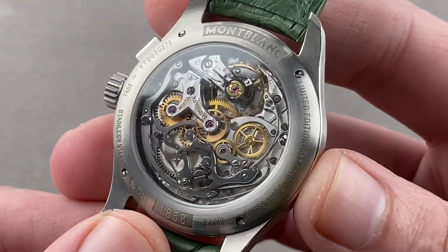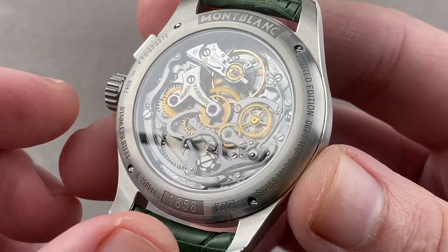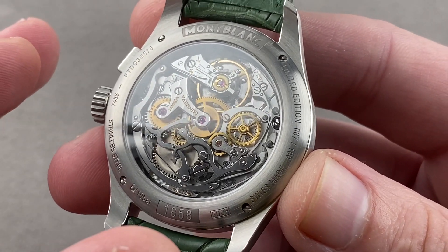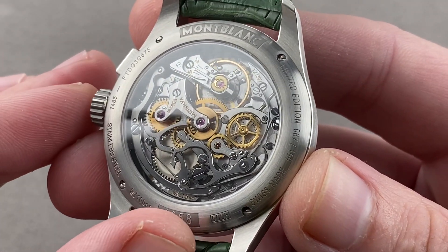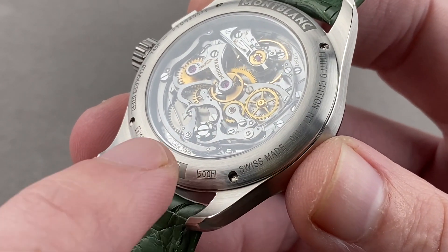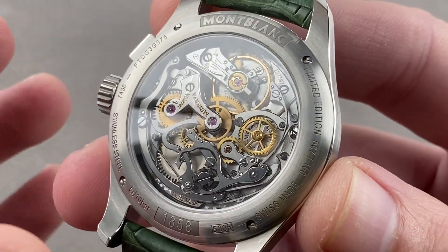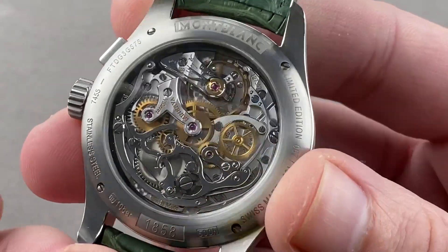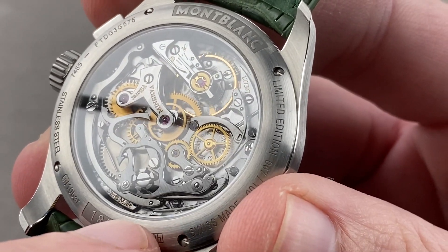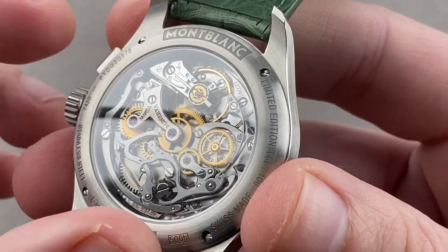Flipping it over, Caliber 1321 is based on the 1920s Caliber 1320, the two numbers variously describing the size of the movement and the year work started. On the reverse side there's a surprise: a stainless steel watch, not expected in this class — but what you also can't see is that it's 100 meters water-resistant, which makes it surprisingly sporty for a timepiece that at first glance appears to be the consummate dress chronograph. Limited edition, individually numbered out of 100, Montblanc puts all of its watches through a 500-hour test of chronometry and durability. Caliber 1321 is smaller than the other Montblanc Villeret Minerva movements, and thus able to fit in a smaller case — it features all of their technical virtues. It is a column wheel lateral clutch chronograph, classically beautiful. It is manual wind with a 55-hour power reserve, pivots on 22 jewels, has a handmade over-coil hairspring so it keeps good time in any physical position with respect to gravity, and it beats at a pleasing vintage 18,000 vibrations per hour.